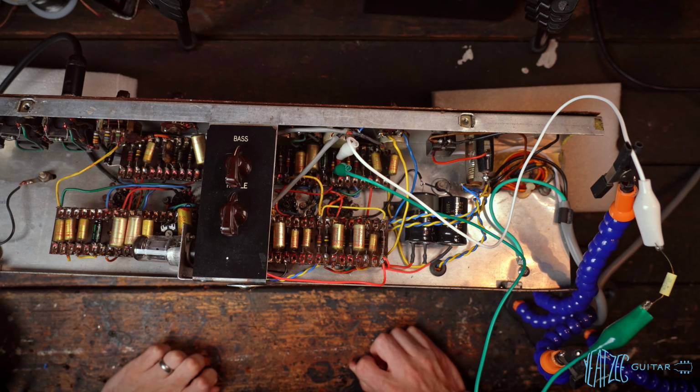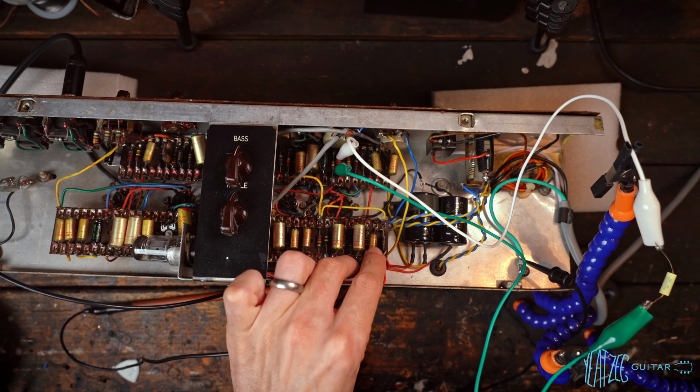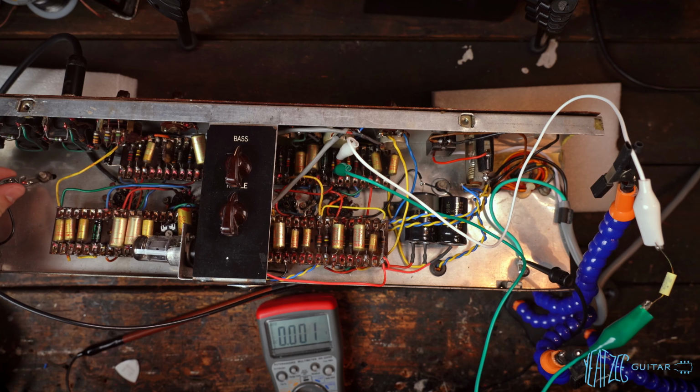So we're dropping volts, which is great. 1.2 volts should show that across basically all of the capacitors in the amplifier because they're all connected. Perfect. All right, so the amplifier is now safe. So we can take this out and we can go ahead and solder it now.